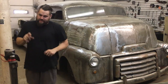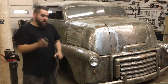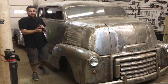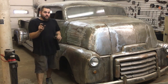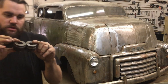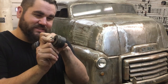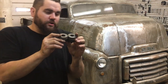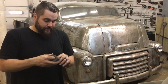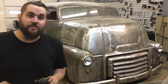The problem I'm running into is it's an inch and a half belt line and I want to run a bead roller. I want to use my bead roller to make an inch and a half lip. Problem is they don't make them — they're only about an inch, usually the ones I can find. So what I'm going to do is destroy a couple of my smaller bead roller dies. I don't use these very much. I'm going to grind these down and try and make my own. It might not work at all, it might work wonderfully — most likely somewhere in the middle. But let me show you what I'm talking about.